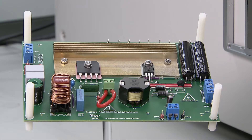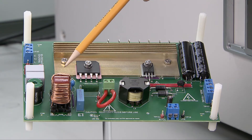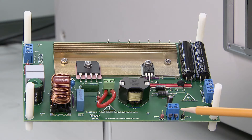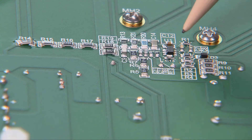From left to right, you can see the AC input connector, EMI filter, bridge rectifier, PFC inductor, PFC switch, diode, PFC output cap, and the PFC output voltage connector. There is also a bias voltage connector to provide VCC to the UCC28056. The UCC28056 is on the bottom side.